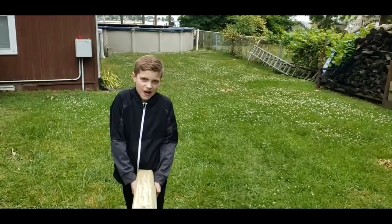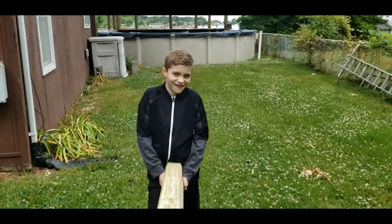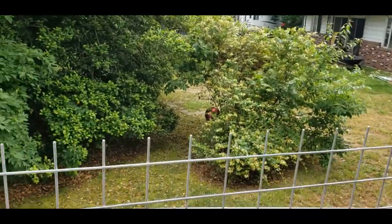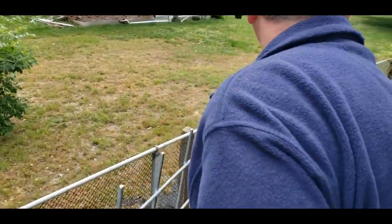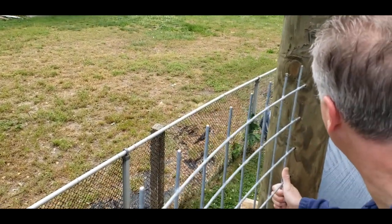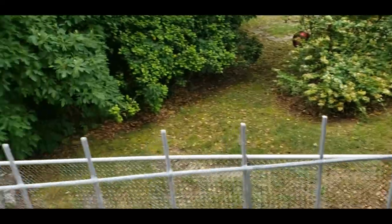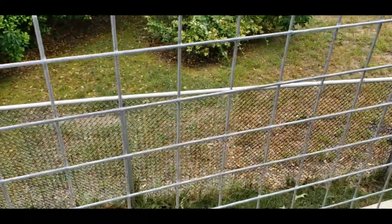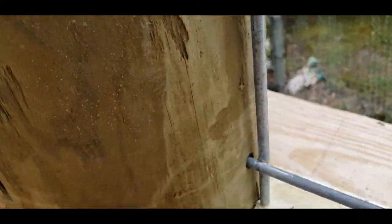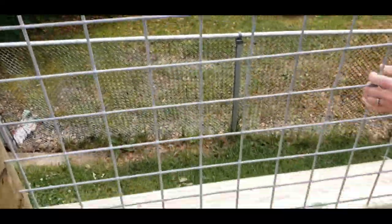This morning we're going to put on the boards — carrying the top and the bottom boards up. Now we've got it in that side and the fence will bend out a little bit and we'll put these in. We've got it all lined up. What you want to do is get an equal distance on this side as on this side, so we're going to pull this fence a little this way and then take a measurement.